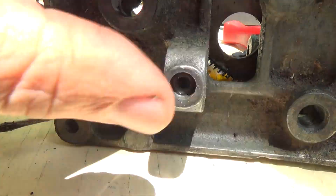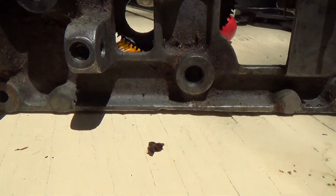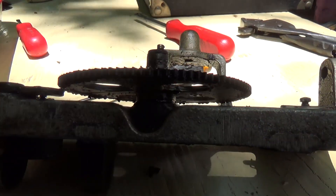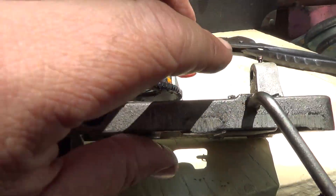Right there — that holds on your winding shaft. That was definitely loose. This gear does not have a set screw; it is pressed in. Don't mess with it. Clean it, but leave it alone.